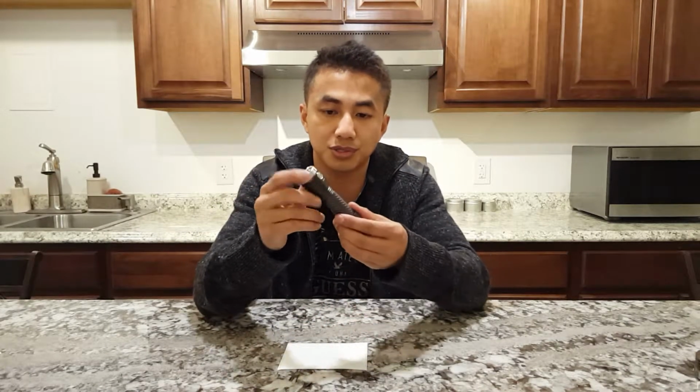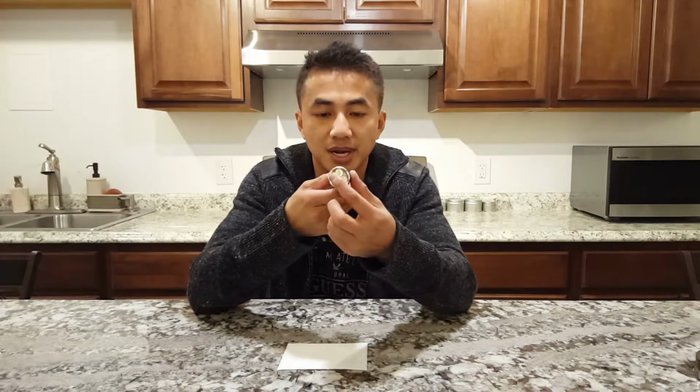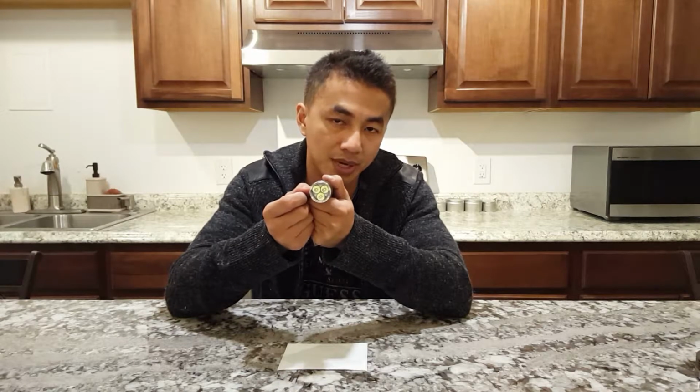It's barely larger than a single cell, and it has very nice optics here, focused down the beam very well. I haven't talked about the lens, haven't I? So it has this triple TIR optics. TIR stands for total internal reflection. Basically, it focuses down the beam to a really round circular hotspot with very minimal spill.